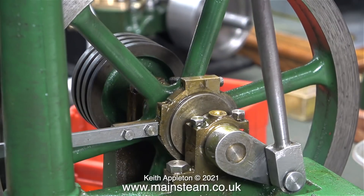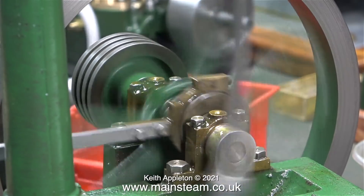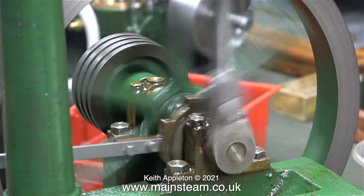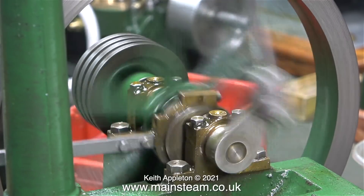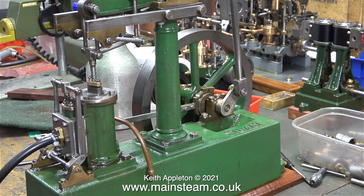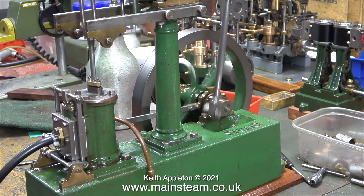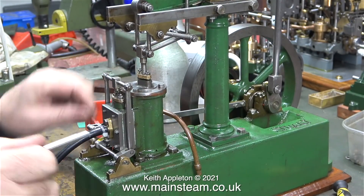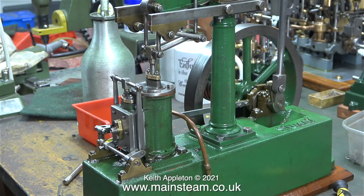This shows the problem with the slide valve. I'm opening the tap on the compressed air supply, then all of a sudden the slide valve slams onto the port and the engine sets off at too high a speed. It's not a massive issue but it's not as good as I'd like it to be. I would like the engine to start irrespective of how much pressure has been applied to the steam chest. The position of the slide valve was a long way from the steam ports to start with.